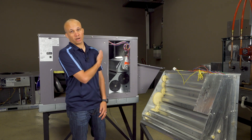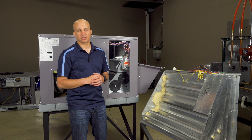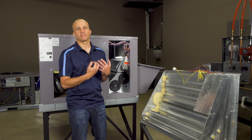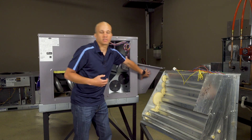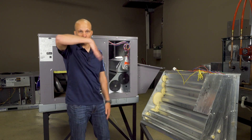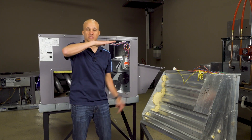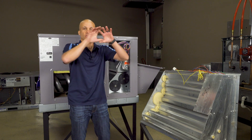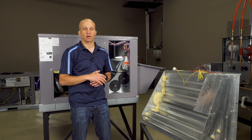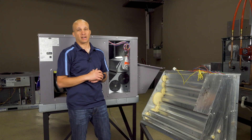We could run your rooftop and your air conditioner, but that's pretty expensive. So if it's 50 degrees outside, why not just bring the 50-degree air in? We have an air inlet that sucks air into the unit and a damper inside. The damper opens up and sucks the free cold air in from outside, then uses your duct system to distribute that air everywhere it needs to go. So you get free cooling without running your compressor by bringing the outside air in.